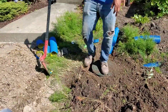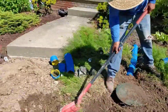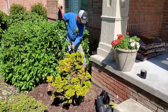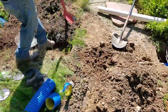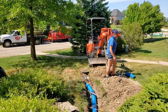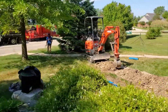Sadly, at Home Depot, they're just giving you a 10-foot piece. Subconsciously, it's got everybody — all the homeowners, all the DIYers, the contractors — wired that 10 feet is what it should be. You have to get further away from the house than 10 feet. Always make sure that you take your run as far away from the home's foundation as you possibly can within reason.